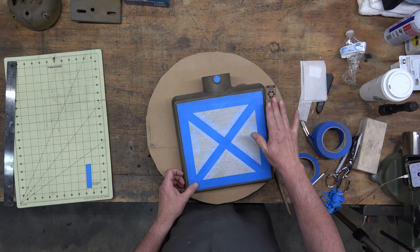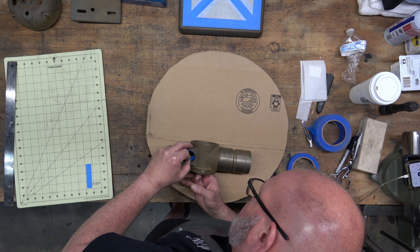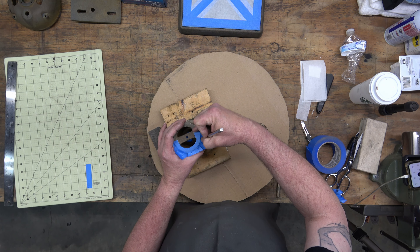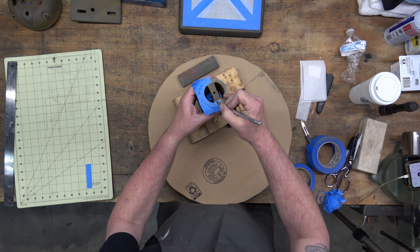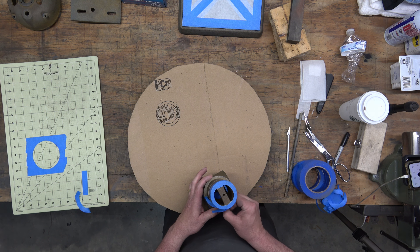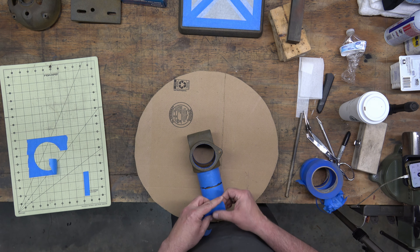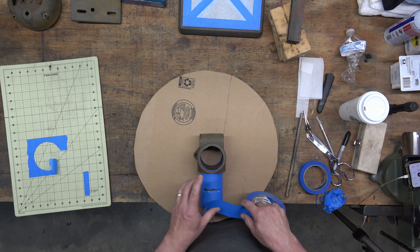So that's the table finished, and you can see I've even masked off the boss for the lock pin. This is the table support. You've got a couple of bores here, and then you've got the actual support itself that sticks off of the column that the table will then slide onto — it kind of functions like a column for the table. It's not going to get painted, so it'll get masked as well. Masking that lip down there is kind of the hard part, but that lip is going to ride up against a milled surface on the back side of the table, so it needed to get masked as well.